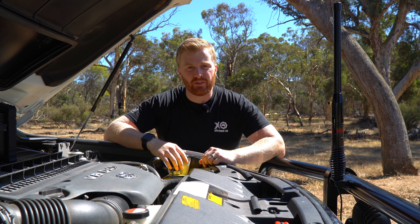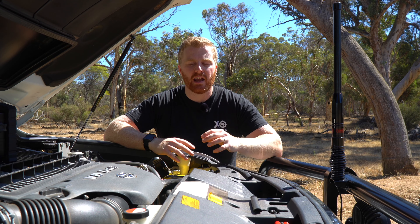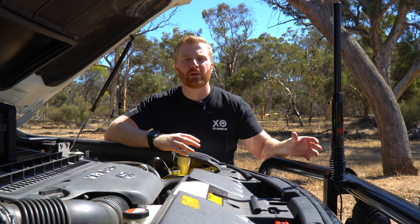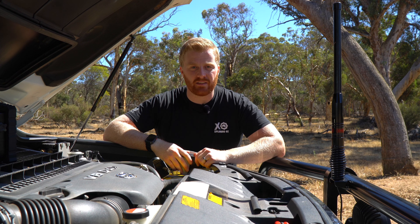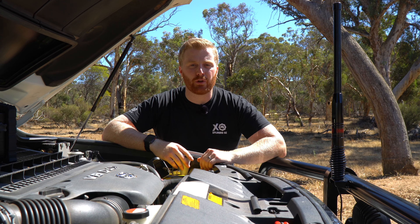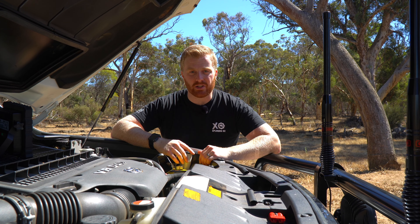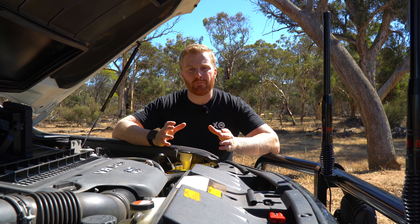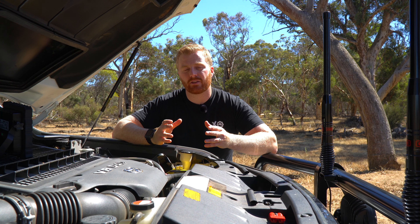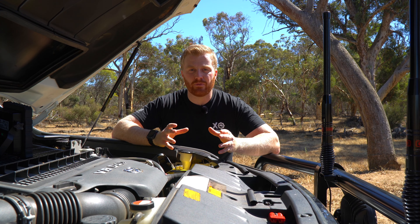For example, I'm running a Redarc BCDC 1240D battery charger in my Land Cruiser 200 series, which takes power from the primary battery and also regulates solar power through external inputs. However, the Redarc can only handle voltage between 17.5 and 32V — and these panels at their high voltages are just not going to work with that setup. This applies across most of the Redarc range: the BCDC 1220s, 1240s, 1250s, and even the Manager 30s all have a maximum 32V input. However, comparing with something like the Renogy Rover chargers at 40 and 60 amps, they can accept up to 100 and 150V of solar input respectively — which will work very well.